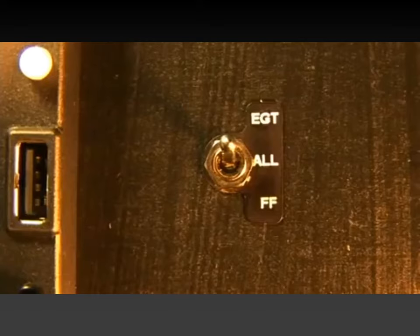In the simplest case, you just say, yep, I start with full fuel, tanks are full, go. If you put in a specific amount, going back to my example, you are on the signature ramp, the fuel is $7 a gallon, and you just need 10 gallons for them to waive the ramp fee, and you order exactly 10 gallons, then you need to pay a little bit more attention when starting the plane. And then you need to tell the engine monitor, hey, I put exactly 10 gallons in. So we're starting with exactly 10 gallons more than where you stopped the last time, instead of starting with full tanks again.